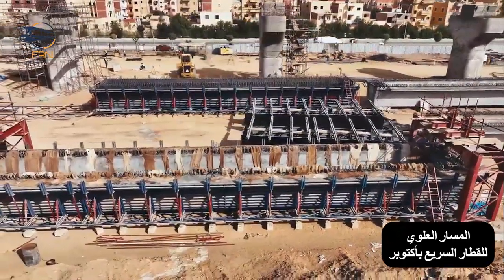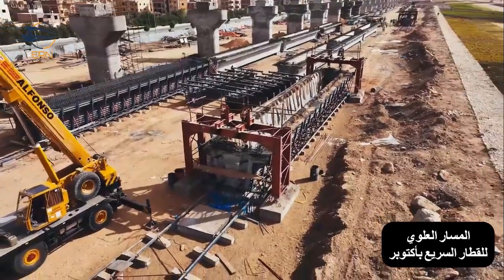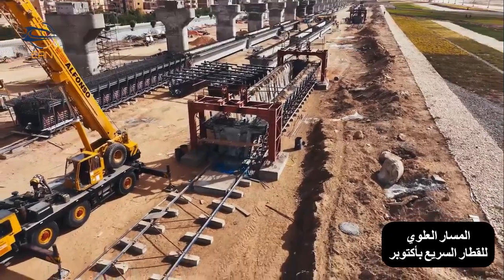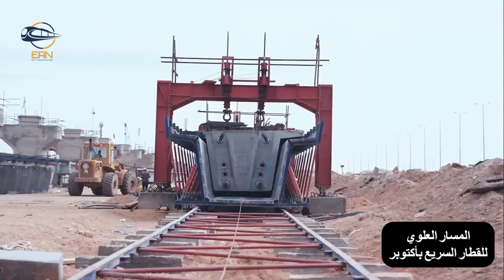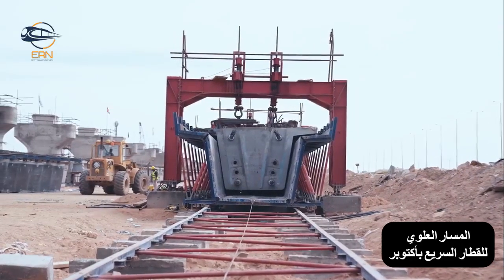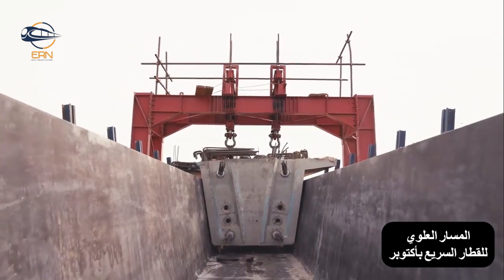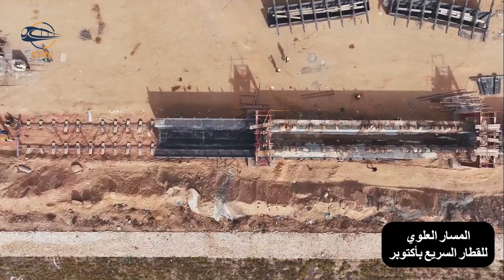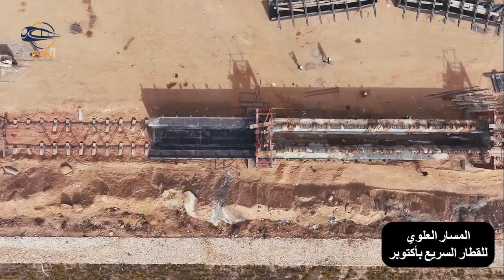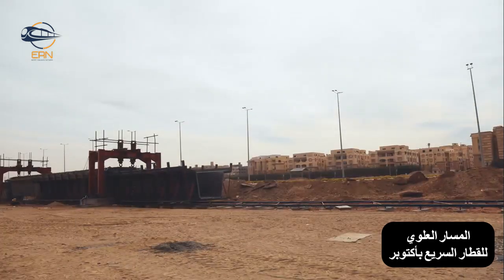Subsequently, pouring commences from both sides simultaneously, maintaining a maximum height difference of 2.2 meters between the two sides. The entire pouring process takes approximately three hours for a volume of 68 cubic meters. After the concrete cures, a lifting frame designed by ACRO is used to raise the concrete structure. Finally, a unique shifting mechanism pulls out the steel formwork at a speed of 25 meters per hour.